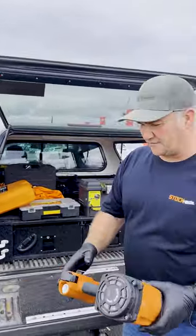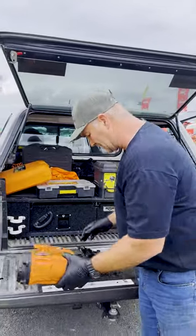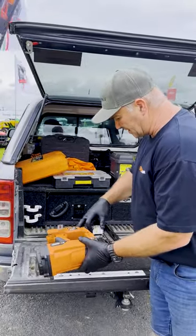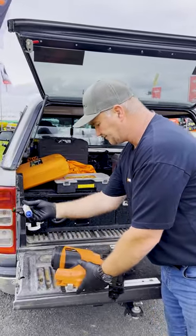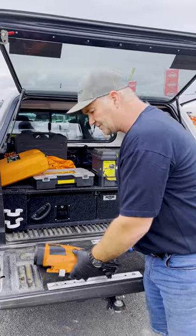The first thing we want to do is make it safe. Take the battery out, take any staples that might be in the magazine off, and eject the gas. Just push the eject button and place them to one side.